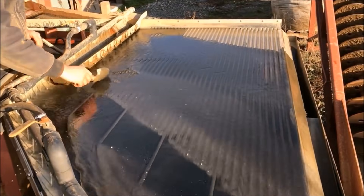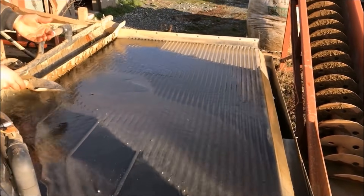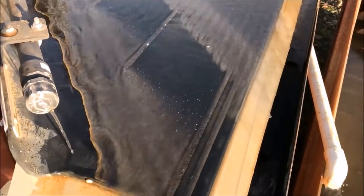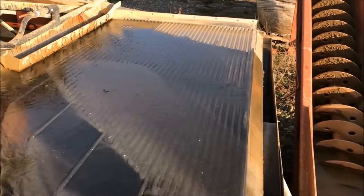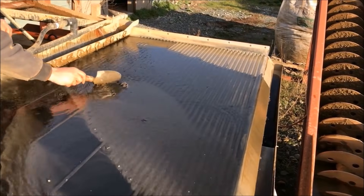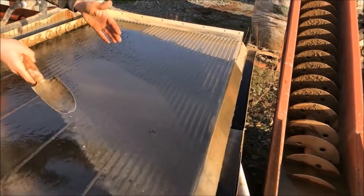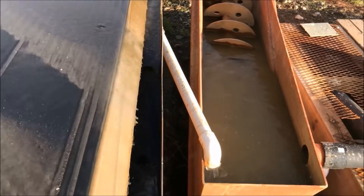What we're doing now is taking our number two and rerunning it on our shaker table to clean it up. There's a lot of sulfides in here with a little bit of gold, and we want to get rid of most of the sulfides. We're running them on the same table used for our production run, but now using the table as a finishing table to clean up our gold. We're feeding the number two right down at the base of the ramp, going about halfway down the table. It's forming a nice wide band of sulfides, and we've adjusted the splitter to capture all the sulfides and run them back into our number three middlings trough.